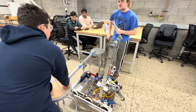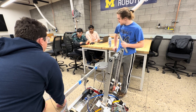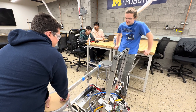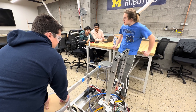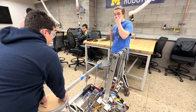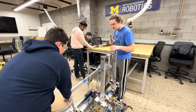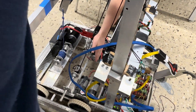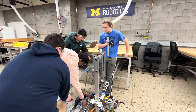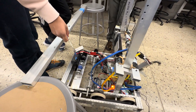You could put a weight back here. More batteries. We did mount the climber remarkably far back on the robot, with a front-heavy robot. The lesson for people watching is: if you want to have a winch climber, mount it near the center of your robot, or at least near the center of mass or gravity. We don't actually need the winch at the center of mass — we just need the cable to be pulling from the center of mass. So if you had a bar here that the cable was going under in the center, that would work. There are no bars here that would support the weight of the robot though, so something to consider — center of mass. Physics. Ask your physics teacher about that.